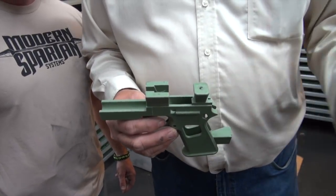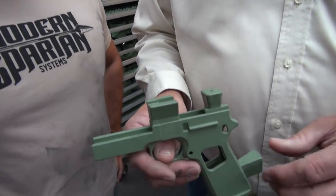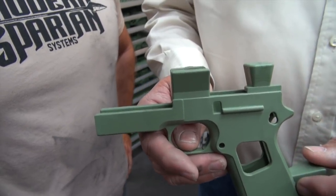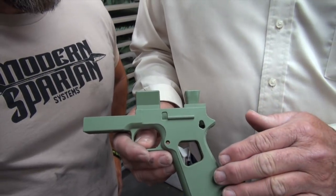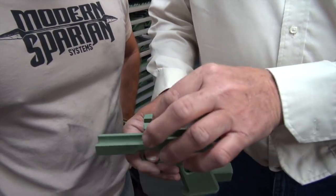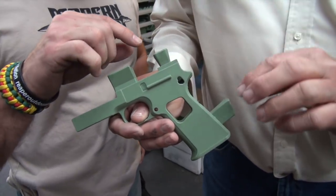We're in the wax room now and Ted's going to talk about the pattern for the Maximus Gladiator. Each of these machines is a wax injection machine — we're injecting molten wax into an aluminum mold to form the part. Our process is utilizing the lost wax method. It's been around about 6,000 years. It didn't become a production tool until right after World War II when they needed net-shaped parts to drive costs down from fabrications or stampings or other means of manufacturing.